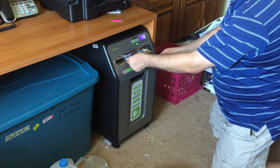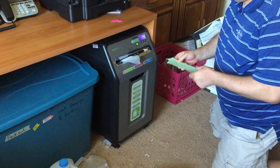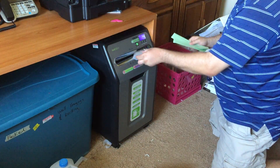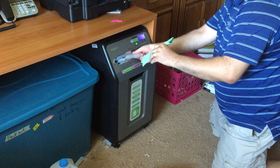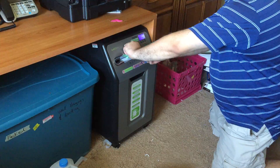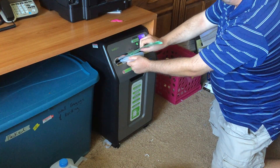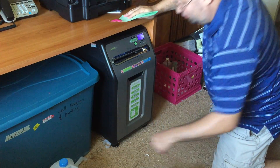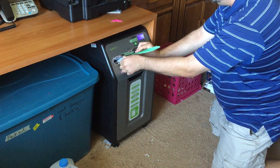It fits, but we have a challenge: we need to actuate the light sensor. I'm just going to use a little piece of paper to actuate the sensor, and the plastic seems to go through without too much difficulty. This is the bottom of the jug, which I've also cut flat so it will fit in there. One challenge with this clear stuff is that it doesn't actuate the photo sensor — we wouldn't have the same problem with the non-clear parts. Here's the handle — we'll run this through, just activating the photo sensor.